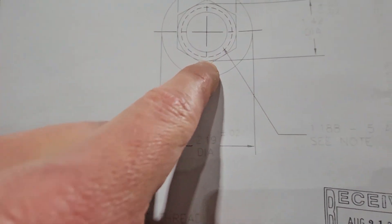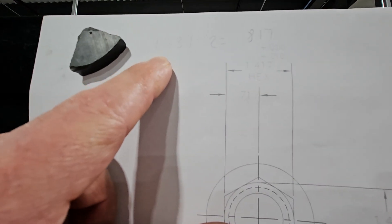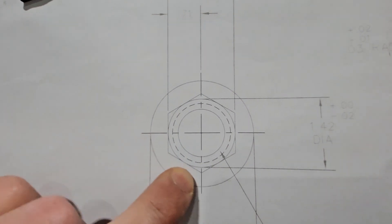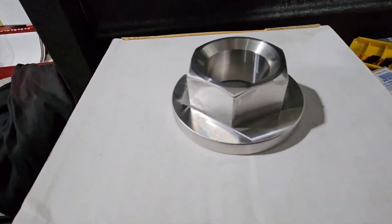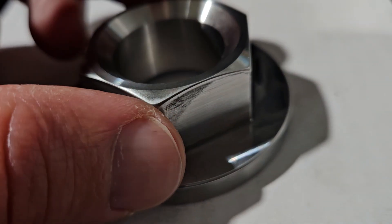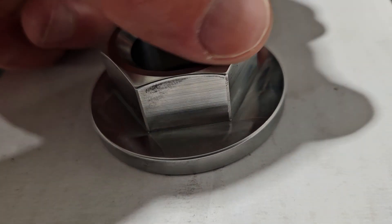This number I'll always keep at the minimum. And that 1 inch and 634 — once you machine it, it will give you sharp edges. I actually go a little bit lower than that, and I'll show you why. This is my hacks. When you go a little bit lower, what happens is it leaves you a little bit of a radius, because technically there's no material here to remove.